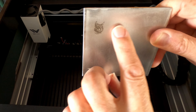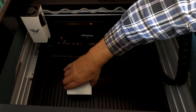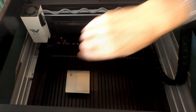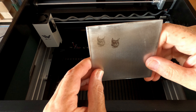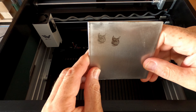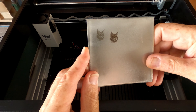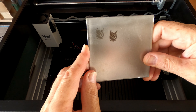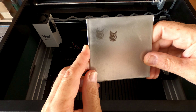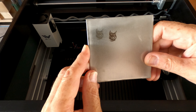I think that came out just wonderfully — wasn't expecting much at all. I'm going to try it again and slow the progress down a little bit, which makes it darker. I'm just going to move that same image over to beside it and I'll be back when it's finished. That's definitely much darker and shows up very well — the quality is just impeccable. Very happy with that. I believe that was done at 100% power and 900 millimeters per minute, or 15 millimeters per second.